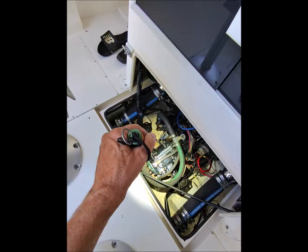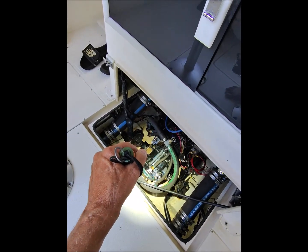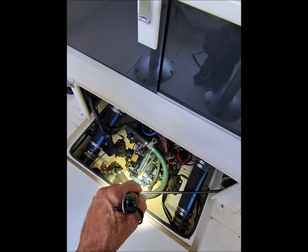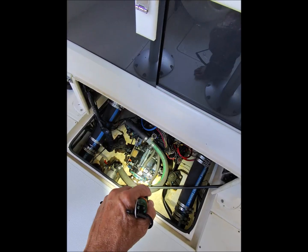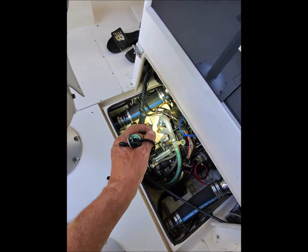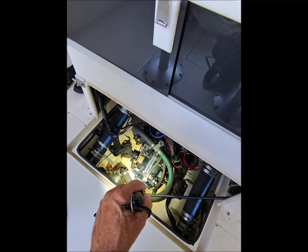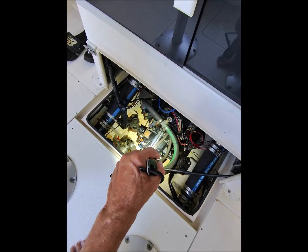the broad categories or theories we have, it's something hydraulic. That's the pressure is not releasing when you're in forward and neutral. There's a theory on top of that that the pressure in neutral has no place to go. The pressure release spring opens in the valve, and one theory is that if this water cooler is clogged, the pressure still has no place to go, so it's backing up in the valve around the tolerances of the fit of the valve, and continuing to put pressure on the forward drive clutches because the excess pressure has no place to go.